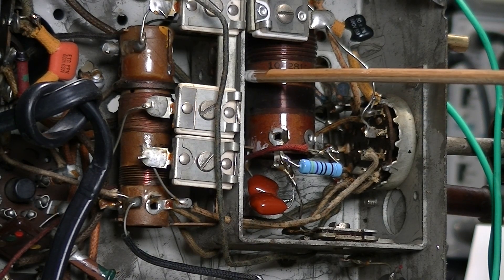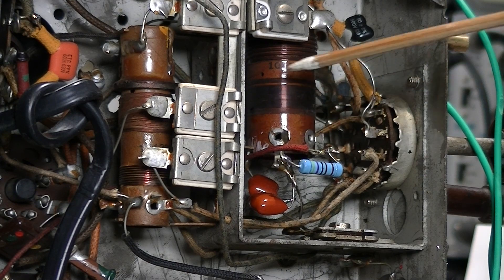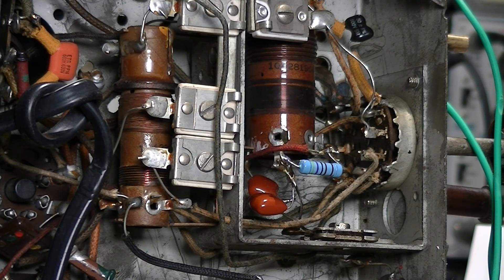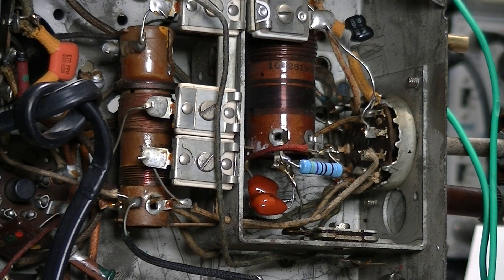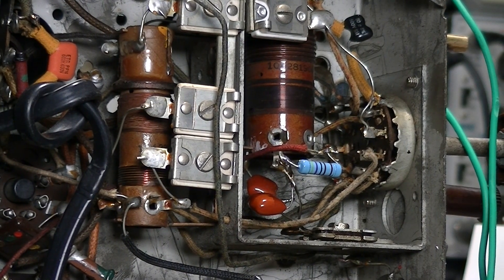There's also another one back there - supposed to be a 0.005 mica - but I can't get in there. It goes to this oscillator coil to ground. The dog bone resistor back there I still can't physically reach, but I could tell it had a brown body - brown means 1, black end means zero, so it starts at 10 - and I was able to get in and check the resistance, getting 100 ohms. I don't see that on the schematic exactly but I got it fixed.